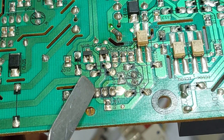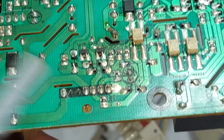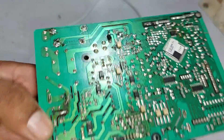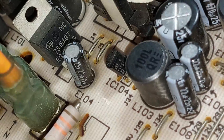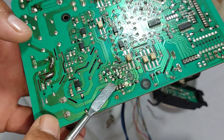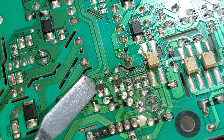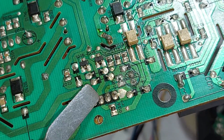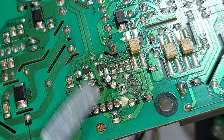The next pin is number 3, through which 15 volts should pass, but they are not coming directly — they are indirectly supplied. This is a 15-volt regulator; the IC number is 7815. In most circuit boards the 15 volts move directly to the connector pin, but this circuit board has a different design. A PNP transistor is mounted here; through this transistor the 15 volts are given to pin number 3. If this transistor does not turn on, the 15 volts will not pass through the pin, and hence the blower motor will not work.